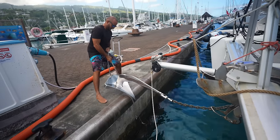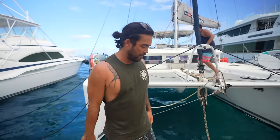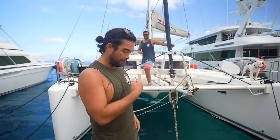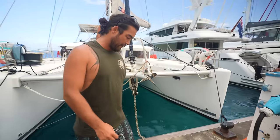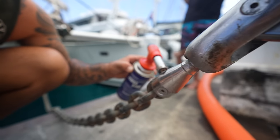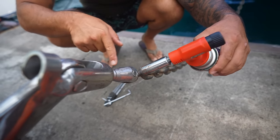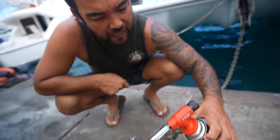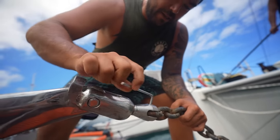We decided it was well worth it to do this exercise in the marina with our bow to the dock. Somebody had burned the head on the allen bolt, so as soon as I put too much force on that it would just spin and we'd be in real trouble. I'm not going to risk it, so I'm going to heat it up to try and melt the Loctite, turn it into a runny liquid again, and then try to back it out. Got it.